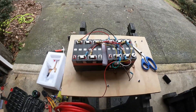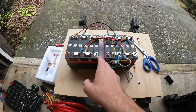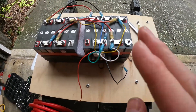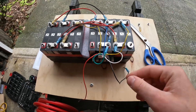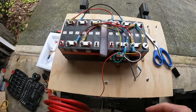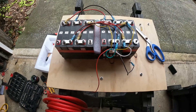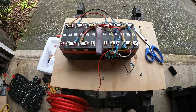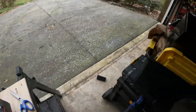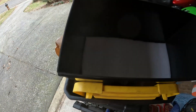It's been about 40 minutes since the last clip. I've decided to cut a space between the two battery packs and put styrofoam in between, so I have enough room for all my wiring. This is the BMS wiring — each lead will be connected except for the main negative and positive, which I'm waiting to do last after the zero gauge goes on. I'm also putting thread locker on the terminals so nothing slips, because a loose zero gauge connection could cause a fire.